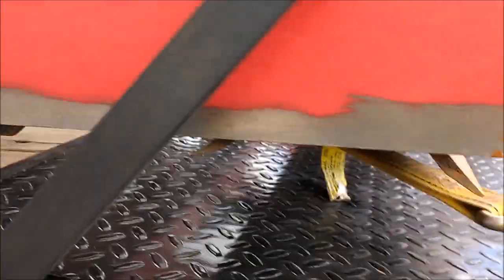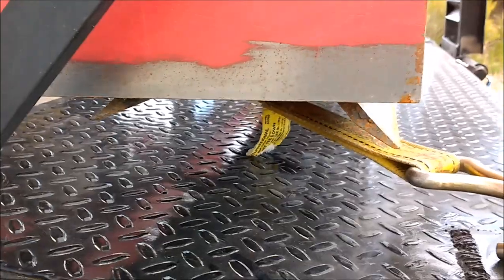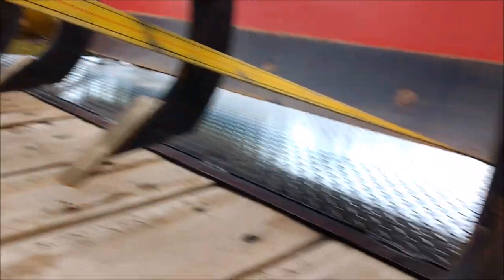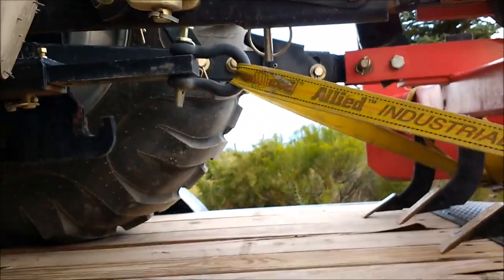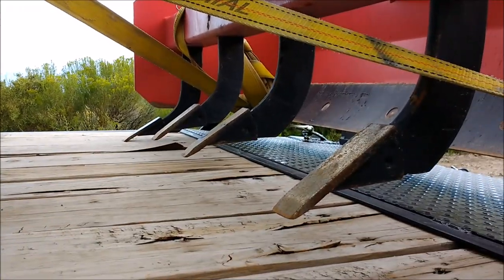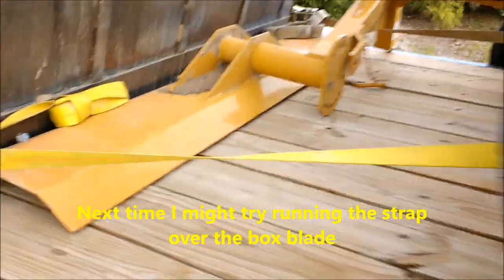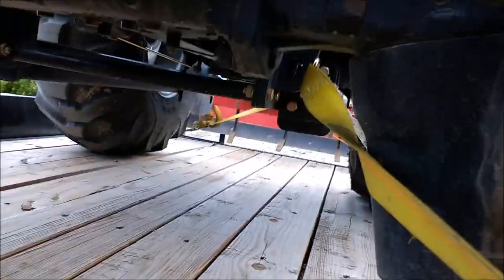Here's how we tied it down: the box blade is almost as wide as the trailer at six feet wide. We lowered the two outer scarifiers lower than the middle ones so the box blade didn't hit the ground, then ran the strap under the box blade, around the D-ring, and back down to tighten it. In front, part of this video is so I can watch it later if I can't remember how I did it — just around the bucket there, and there are two holes right here that the straps hook into nicely.